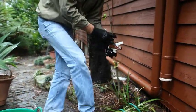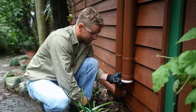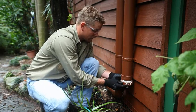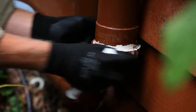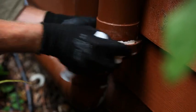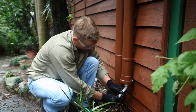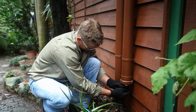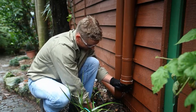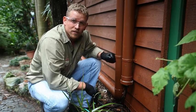It's now a matter of putting it back together, waiting for rain. Insert the ball first, then the larger cap, the filter, and then the black fitting at the bottom, followed by the irrigation hose. And that's one first flush cleaned.